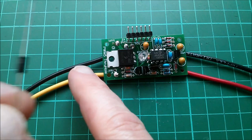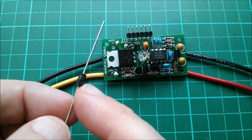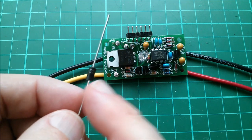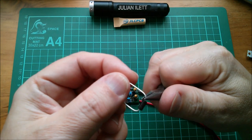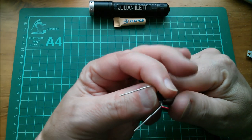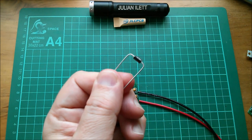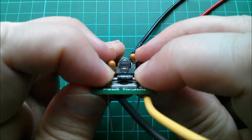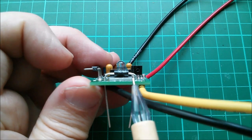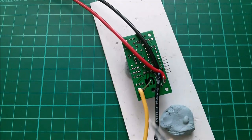These transient suppression diodes are used to take out high-voltage but very short-duration spikes. On solar panel wires that could be several meters long, if you get a little spike this thing will clamp it down. It can dissipate 600 watts for a very short duration - obviously not for any length of time, that would cook the component. I need to bend it with tighter radii so it doesn't come down and touch the edge of the MOSFET. That side needs to stay up and away from the tab because they're not the same connection.